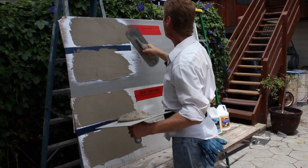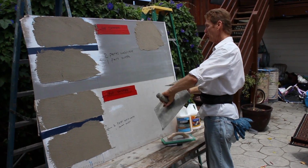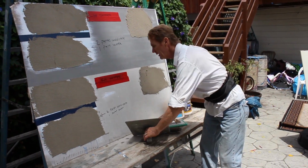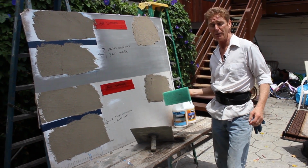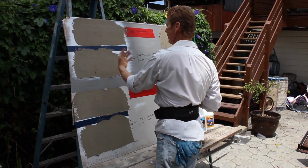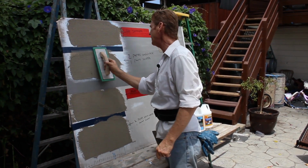I want to point out, guys, I'm just going to put this right here because I can. This is over sheetrock, which has a lot of suction. These won't spider check because it's designed for that. Again, all of these bonding agents, if you use them according to their description, will not fail. The reason we get spider checking is, again, because of the moisture being trapped. It can't suck in. If it can't suck in, it has to dry from the outside. Therefore, it'll spider crack.